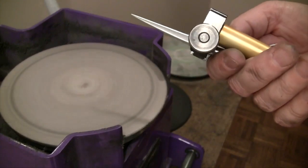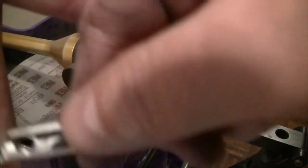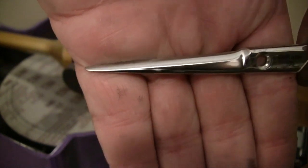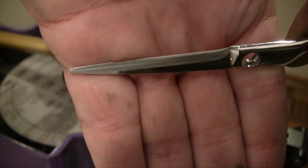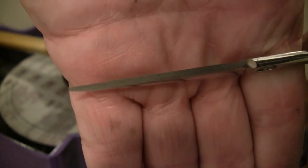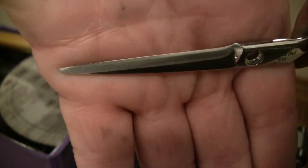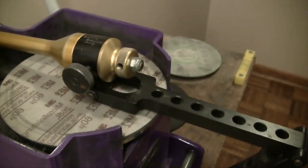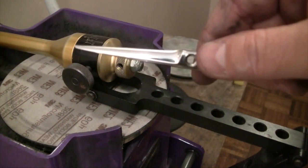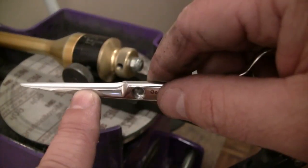I'm going back a little bit more to make sure everything is nicely smoothed out, using very light pressure and letting the disc do the work. Let's see what we've created — you can actually see how I've rounded that surface out. You can see where the rough cut is from the disc, and we're going to smooth that out with the 30, then the 15 and the 9. In this case I have to go through all the different sharpening steps to re-smooth out this convex front surface. Because there are such heavy scratches on the front surface right now, you have to be really careful — all those scratches will show up if you miss anything during this process.